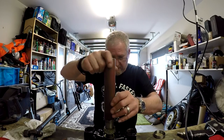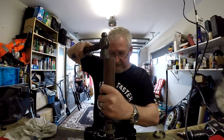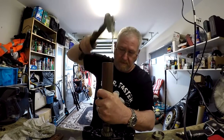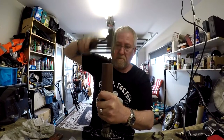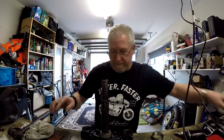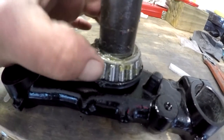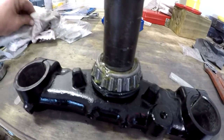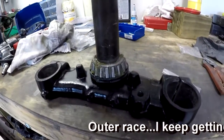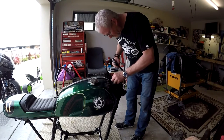That's packed. I've got a bit of pipe with another bit of pipe welded to it - it sits down into the inner race so that it's not hitting on the outer part - and we should be able to just drive it home. There it is - we haven't damaged the bearing at all. It feels a fair bit of resistance because there's grease in there but that's lovely. Now I have to put the inner race into the frame. I've already fitted the bottom race - I'm just going to knock the top race in.